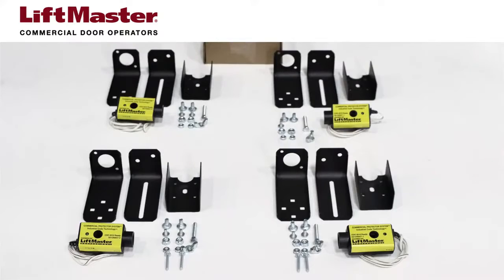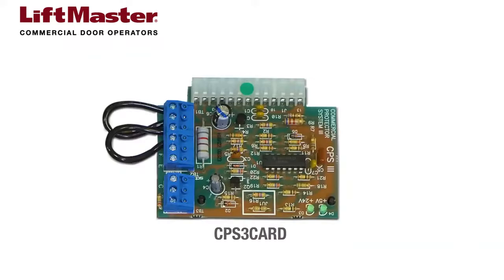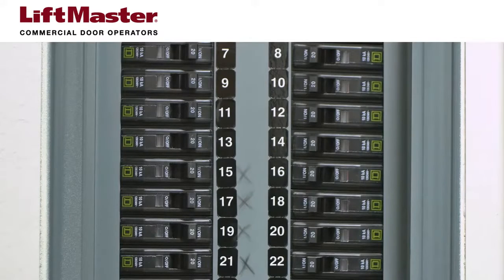For this demonstration, we'll be installing CPSU photoelectric sensors on a commercial door with a Logic 5 operator. Your installation may vary. Installing a second ancillary entrapment protection device requires the installation of our CPS3 card. Disconnect the power to the operator before beginning the installation.